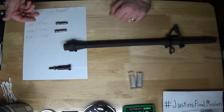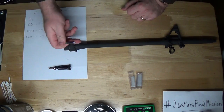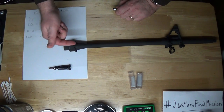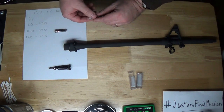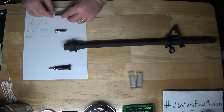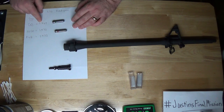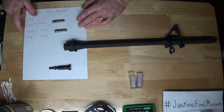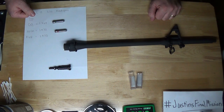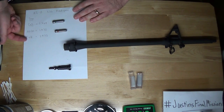What is a headspace check? Every firearm needs a headspace check. The headspace is basically the chamber bore in your barrel — it's going to make sure that your cartridge fits in there right. Basically it's like the Goldilocks thing: not too short, not too long. The go gauge for the 5.56 round in an AR-15 barrel measures 1.464 inches. The no-go gauge is 1.470 — that's only six thousandths of an inch difference. There is a third gauge called the field gauge.